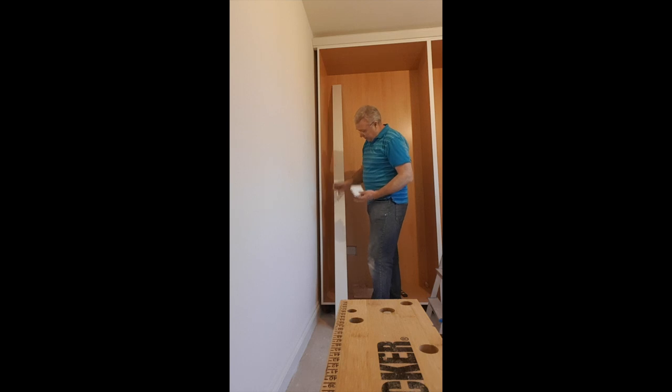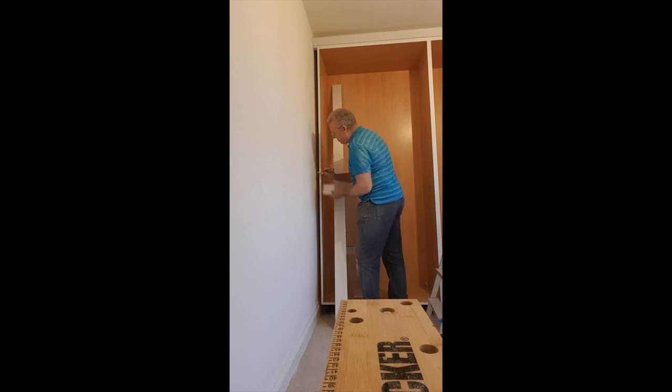But you can also, before you cut it, mark this one and mark one at the other end of the room as well. That just gives you two bites at the cherry if you're a bit worried about getting it right. So, if we were cutting this piece to fit in here, it'd be quite simple. We could just measure that, whatever that would be, 42 millimetres, mark 42 millimetres, cut it. We could offer this up and we could mark it on here. We could cut that. And if we want this straight edge over that distance, we could just spin that round and fit it in here.